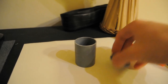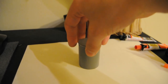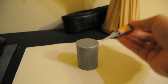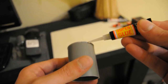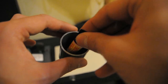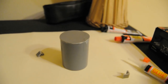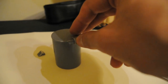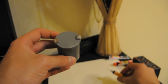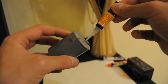To start with the cylinder, glue a pipe cap or plastic plate to the end of the pipe. Note that if you use a plate it might fail soon. I reinforced the cylinder with plastic corners and now we are going to drill some holes for the tubes and glue them with super glue.